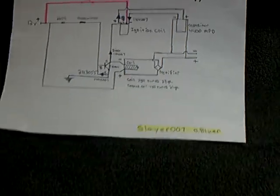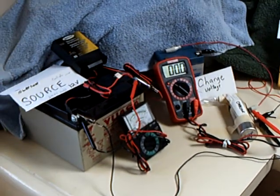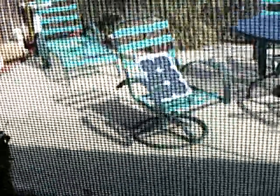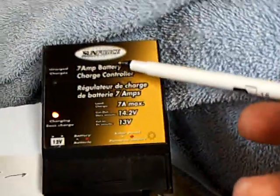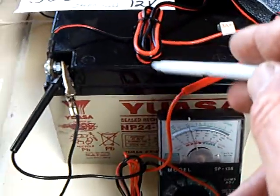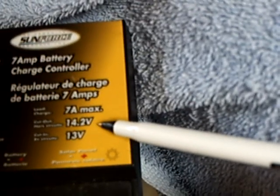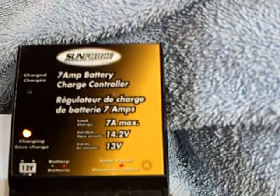I really like what he's doing here and I've got the kitchen countertop thing going on again — it's just easier to show what's going on this way. I've added a couple of twists: I've got a 10 watt solar panel out there feeding into a source battery, controlled with a controller. I'm eventually going to set this up as a permanent thing, probably with my 40 watt solar panel. It'll charge up this sealed acid battery. You can keep it in the house as long as you have a controller — the voltage goes up to 14.2 volts and then turns off, the green light comes on, and it just stores up all day long.